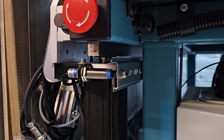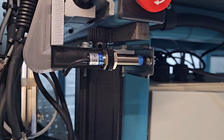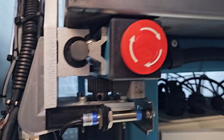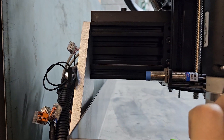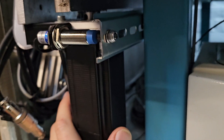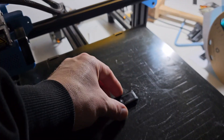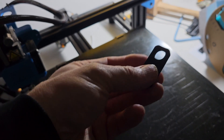Had a minor issue with homing on this Y-axis — the proximity sensor and my other sensors are running head-on like this, and this one is going back and forward, so it's glancing it. I think where it's shooting past it a little bit it's causing an error.